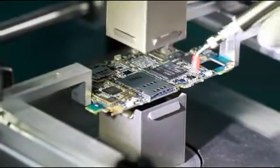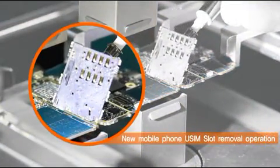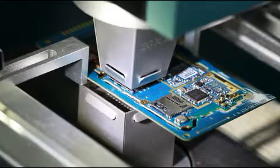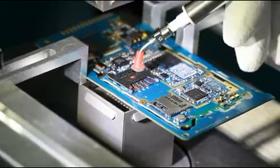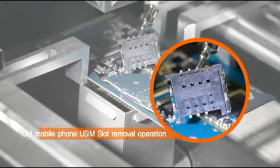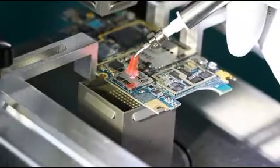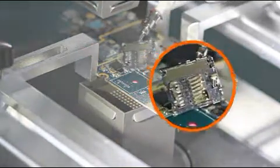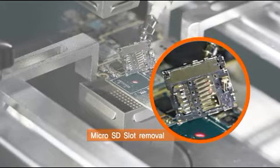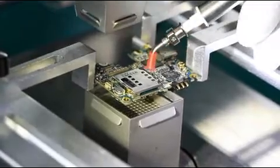The following video demonstrates removing various components from a smartphone PCB. There may be plastic heat deformation and PCB damage caused by high temperatures when removing components with plastic materials using a one-dimensional device like a heat air fan. With the BK-350S, components with plastic as well as DIP-type components can be removed to a reusable quality. The video will show various components being removed using the suction device.